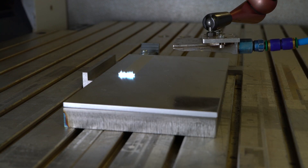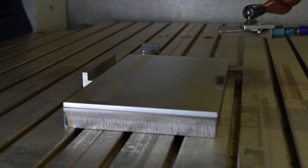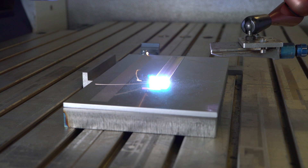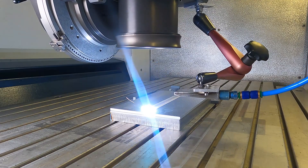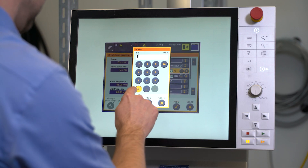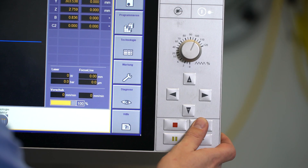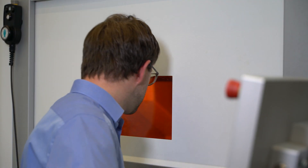In today's example, we are showing different levels of structuring on an aluminum sheet. Of course, most other materials can also be structured with our lasers by simply adjusting the process parameters to optimize the results. Different laser parameters are required to achieve the different structures, designs, and levels of roughness. These parameters include power and pulse energy, pulse repetition frequency, and process speed.